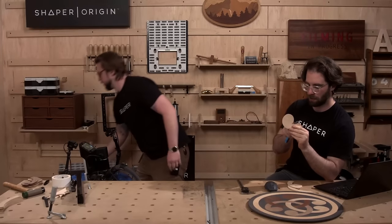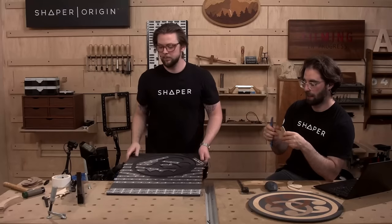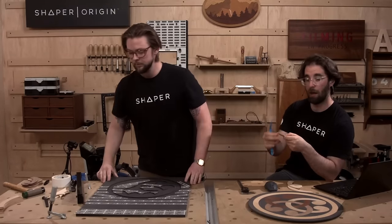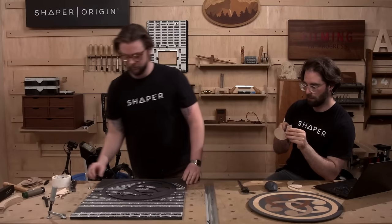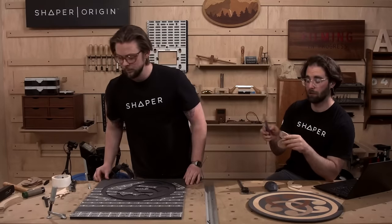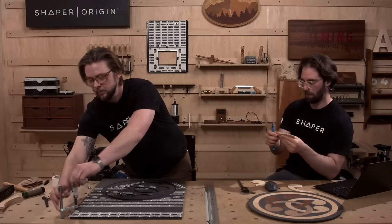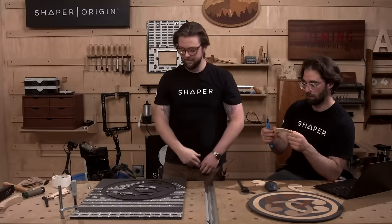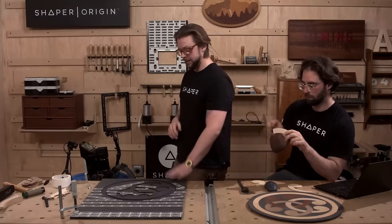But if you wanted to use just hardwoods for this, we've been using the Intense Black from Rubio Monocoat. And one thing that you could do is cut this pocket, pre-finish the pocket with this Intense Black before you glue everything in, and then go ahead and glue everything in after the fact, and that would give you a really nice hardwood solid black surface. They don't call it intense for nothing. Yeah, it is pitch black.